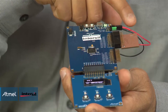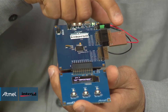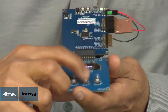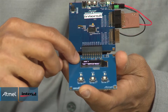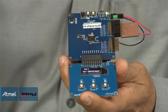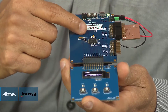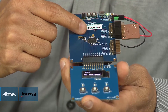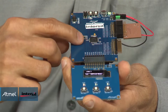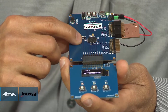I will demonstrate to you how this RGB sensor can put out a lux value or a color temperature value. What the RGB sensor does is sense the light, converts that into RGB information, and that RGB information is then transformed into a color temperature value using some of the tools that are already available using Atmel's SAMD20 Sensor Hub.